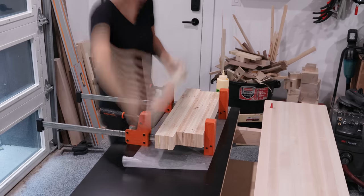The idea of cutting into my brand new workbench top was really nerve-wracking, but a good setup with my six-in-one jig eased those nerves. I lined up the right edge of a quarter-inch bit with the right pencil marking and double-side-taped a hard stop to the underside of my jig. Then I adjusted the fence so the left side of the bit was touching the left pencil line and locked the fence in position. Next I moved the router so the back of the bit was touching the back layout line and double-side-taped one of the extra fence pieces directly to the bench top.